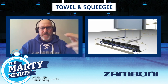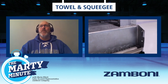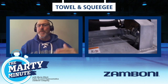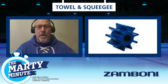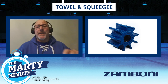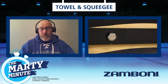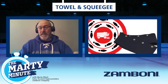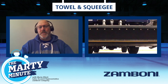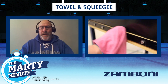The squeegee is critical because it affects the performance of your wash water recirculation — making sure you're actually circulating your wash water back into its container. When people say their wash water isn't recycling properly, the operator will often go check the wash water pump impeller, but it's not always that. Sometimes it's the squeegee — it can be ripped, torn, or not cut properly. During your circle check, pay attention to the squeegee: if it's getting dirty or dried out, it's time to change it.